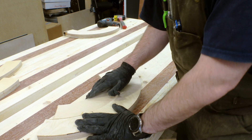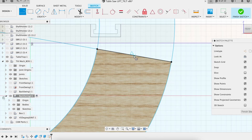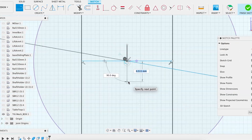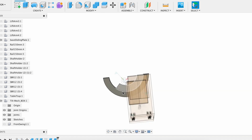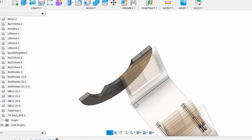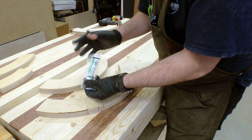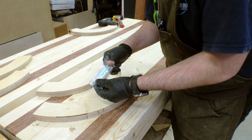When I made these circles, I made sure that the center point of the circles up here is in the center of the saw blade all the way on top of the tabletop. That way, when you use this tilting mechanism, the saw blade will stay still according to the surface of the tabletop no matter what angle it's in. This is important because you don't want the saw blade to move on top — otherwise you would have to change out the saw blade insert every time you change an angle. This way you can use the same table saw insert but use different angles. I saw this tip on Wintergatan's YouTube channel; he's building an amazing marble machine over there, so go and check him out.